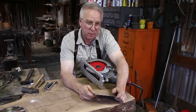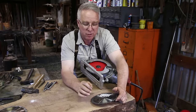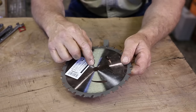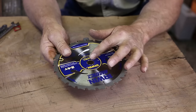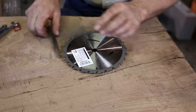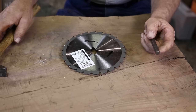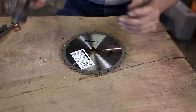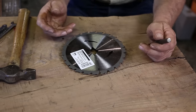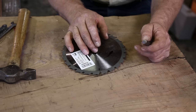I just somewhat clumsily twisted the knockout out of that Diablo. Let's see how we do if I arrange a situation where I can knock it out — it's exactly the same thing. Irwin has the knockout nicely delineated on one side; it's a little buried with paint on the other. So I'm going to center it over these little iron spacers, take a punch, put it on there — it's out.